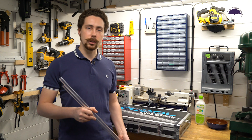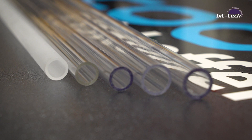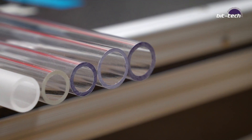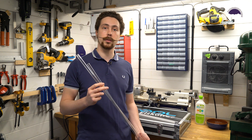The first variety that we're going to look at is PETG. PETG is an easier to bend alternative than acrylic and is very popular with people starting out their loops, and also trying to do more complex loops in the future. It comes in two commonly available sizes: 16mm, and 12mm or 13mm depending on the manufacturer you go with.